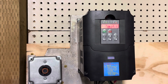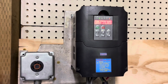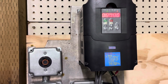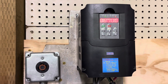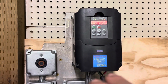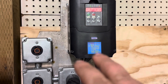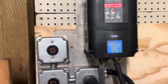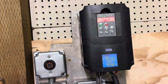The problem is the inrush amps from the mag starters. When you first kick on an electrical motor to get it spinning up to speed, there's what's called inrush amps. Those inrush amps, based on the code of the motor, are many many times the amps it normally draws. So when this is running at normal 60 Hz and you hit that mag starter, it creates a very sudden draw on the VFD and it tries to keep up — and it can't — so it overcurrents.